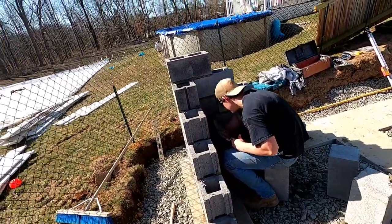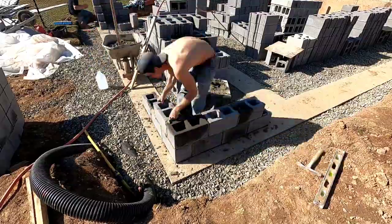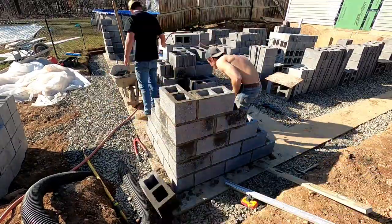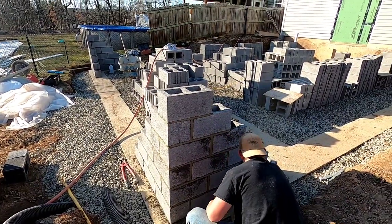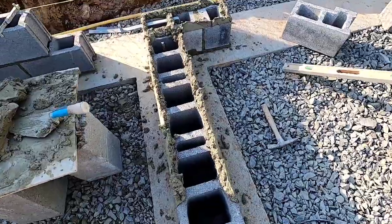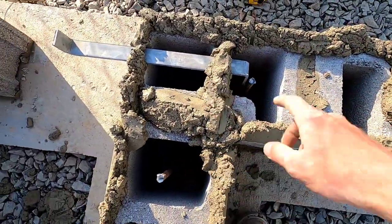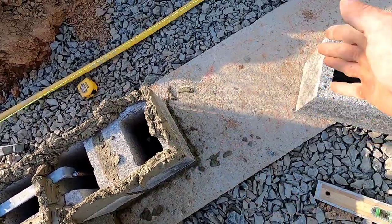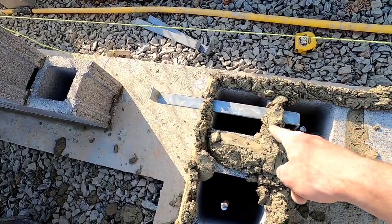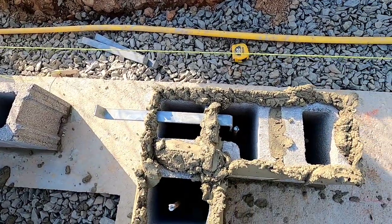This outside corner is done — perfect height. Jake Martin is striking up this lead. Outside corners are established. Starting this 10-inch corner — first course is done, hardware in, three rebars. I have a jam here — this is going to be a bank entrance into the basement. I know I have a porch wall here, so I got these S-hook looking bars going to hang out over like that so I can tie right into it and don't have to drill pins when this sets up.